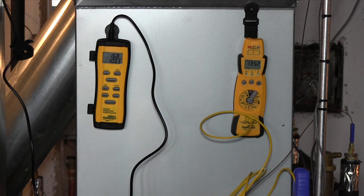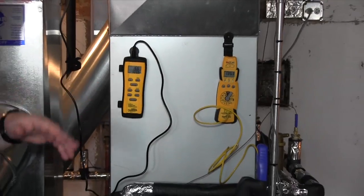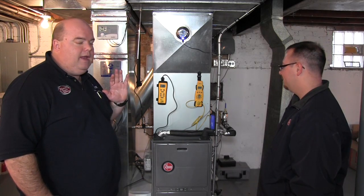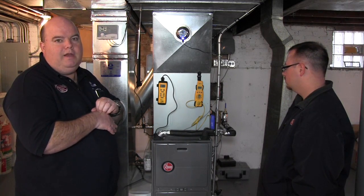Probably what I'll do for the summertime is just set the domestic hot water for 120 degrees, and in the winter I had it set at 125. I honestly left it alone because at some point if we do end up selling this system, I want to make sure the sizing and everything works. No matter how cold it was, I left it alone and never had to play with the water temperature because I wasn't getting enough heat.